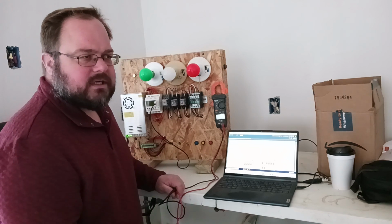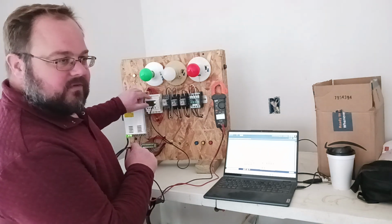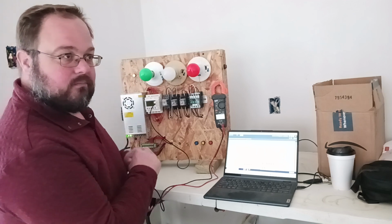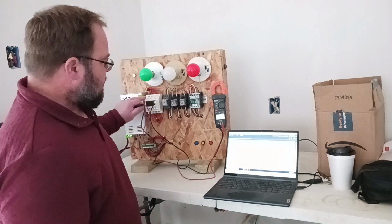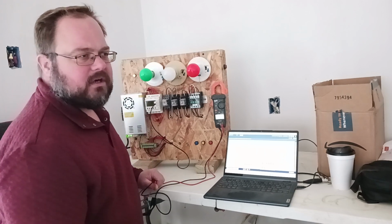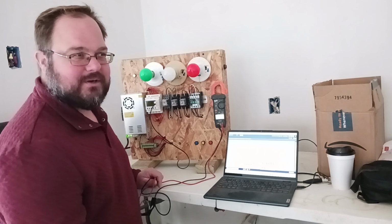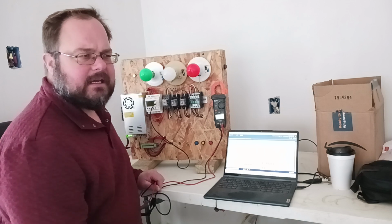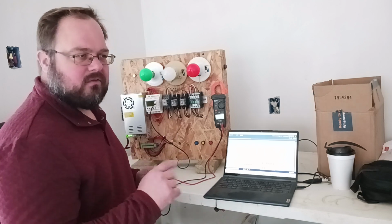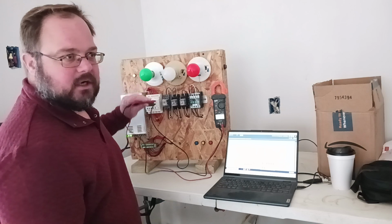So one thing you're going to want to check is to make sure the sensor is working, right? On my PLC, up top are the inputs, and you're going to want to know what the inputs look like. Every PLC may be marked a little bit differently. Just because my input lists them as I1 through I4 and IB through IE, there may be another company like Delta who lists an input as DI for digital input. And then, of course, you're on the digital side because their analog is like, I think, 1A or something like that. But anyway, you'll want to know first of all how your inputs and outputs are marked, so that you'll know what to stick your meter on, right?